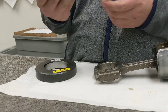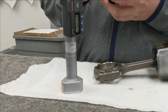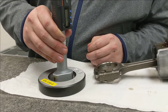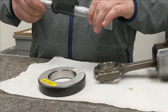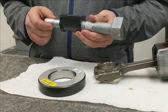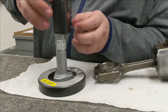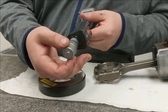To use this bore mic, make sure there's no debris on it — no little rocks or anything else. Take a calibrated ring gauge like this one, and make sure it's clean as well. This is a precision ground surface. The ring gauge is set for 2.50015 — that's two and a half inches and one and a half tenths. When opening this up, you only want to work the ratcheting portion right here; don't grab down lower or you'll over-tighten it and screw it up.